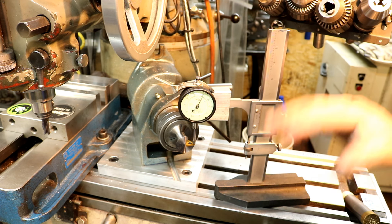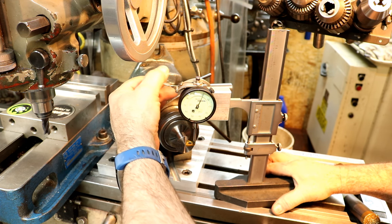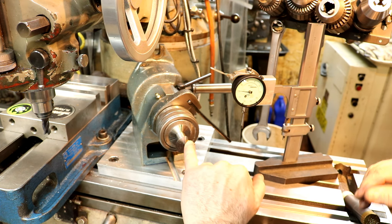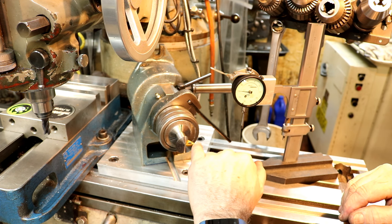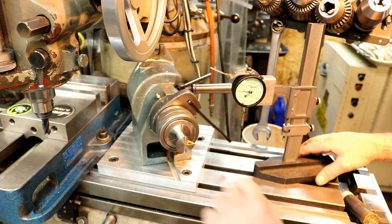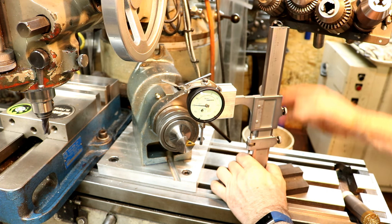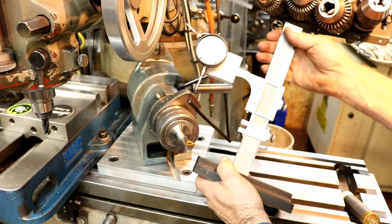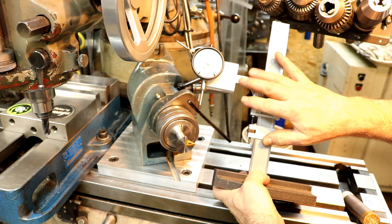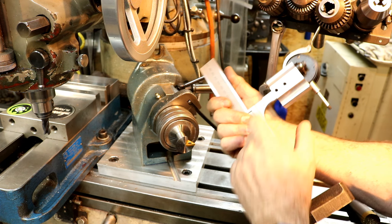This is the tool I've been designing and working on so I can measure dovetail cutters quicker and easier while I'm milling. I have a dovetail cutter set up in the fixture and I've leveled this out to less than a thousandth — closer to half a thousandth or less. This is a demo. I took a 24-inch height gauge, turned it over, and mounted a block that I machined, mounted with set screws.